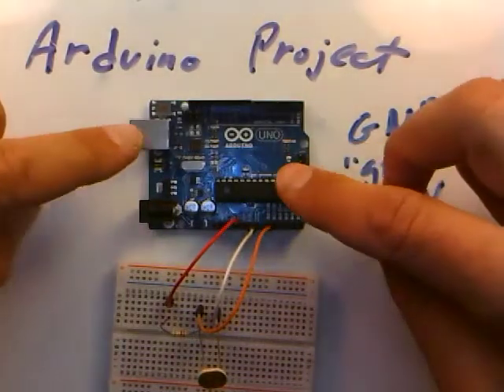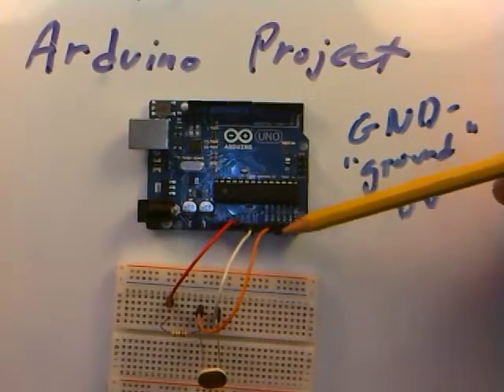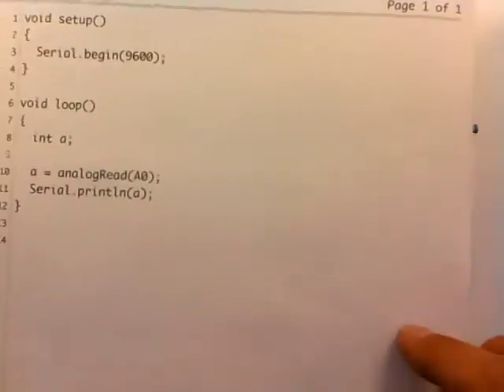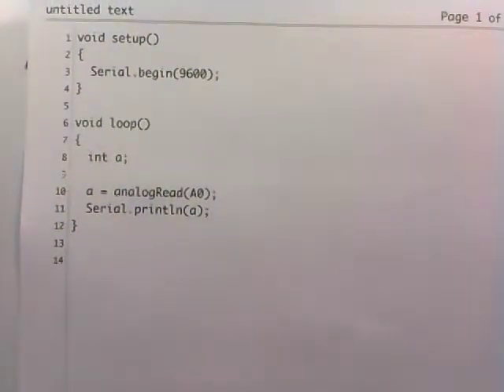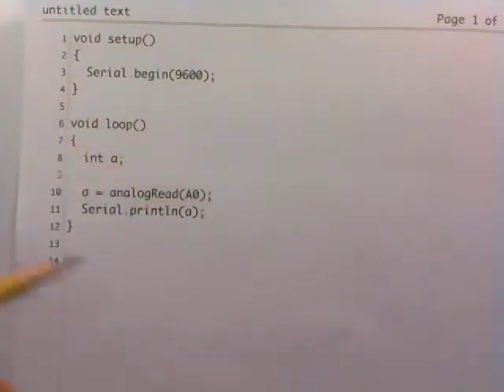What do you do next? You plug this into your computer to power the circuit on, but now you have to tell the Arduino what to do with the voltages it's reading into A0. The way you do that is you go to the Arduino website, download the development kit — which is free — and you type this program into that software, hit the compile and run button, and the computer with this free software will compile the code and send it through the USB cable from your computer into the Arduino. Every time the Arduino is powered up, it'll just start running this code.